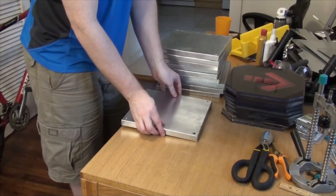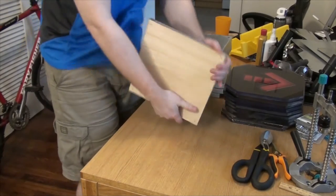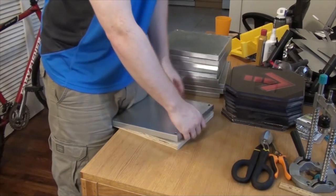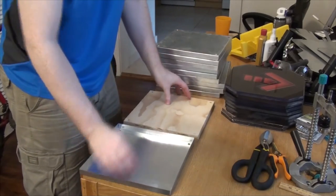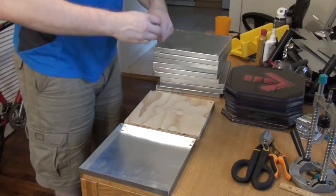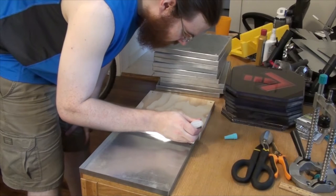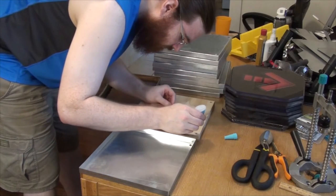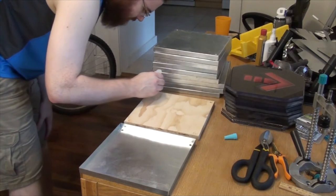To fix some of the problems I had, I took off all my stationary panels because those all need to be repositioned and redrilled. I figured while I had them off it would make sense to do something about this countersinking problem. The solution I chose was to put some adhesive between the metal and the wood so that if they're just stuck together, the screws holding down the wood can also hold down the metal. The particular adhesive I'm using is called DAP Rapid Fuse. It smells and looks and acts pretty much like any super glue, but bonding metal to wood is listed as something it can do, and I tested it and it seemed to work.